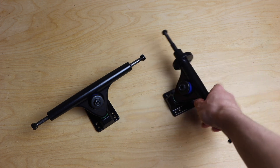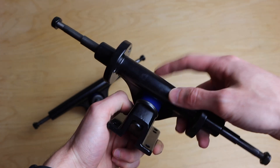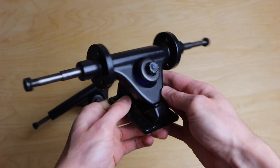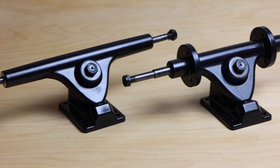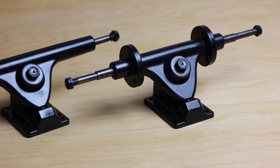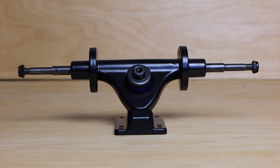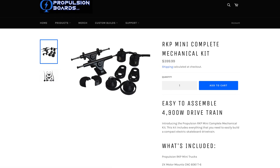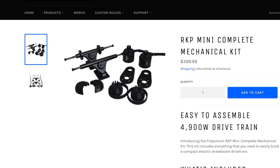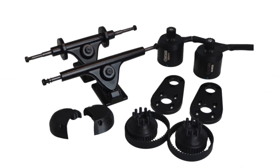These trucks are pretty hard to find, so if you're looking to do a similar build, we are actually releasing new mini RKP trucks with built-in motor mounts. They feature the same 10mm to 8mm step-down axle found on all Evolve boards and DKP clones, meaning all compatible wheel pulleys work with these. They also feature the exact same motor mount bolt pattern, so most motor mounts for those boards will work here too. We have a pre-order going right now — link in the description — along with a full RKP mini complete mechanical kit including motor mounts and 6355 170kv motors.